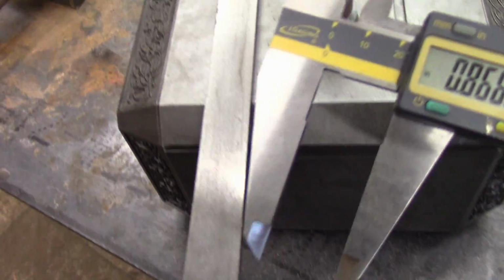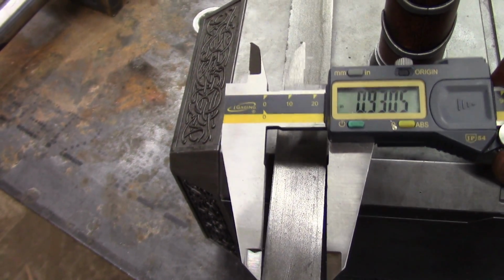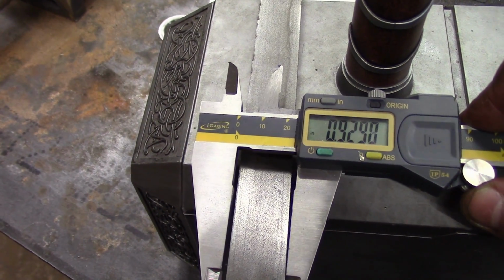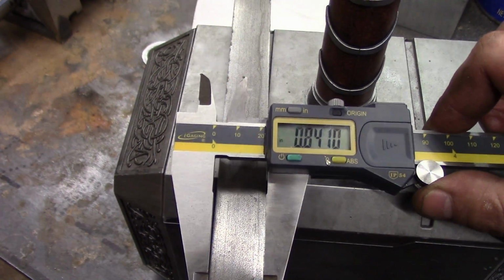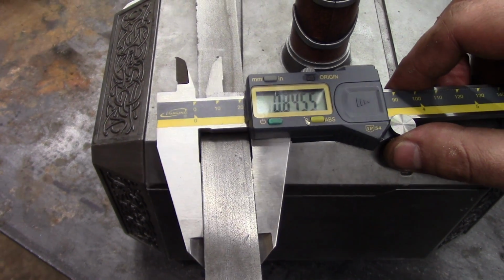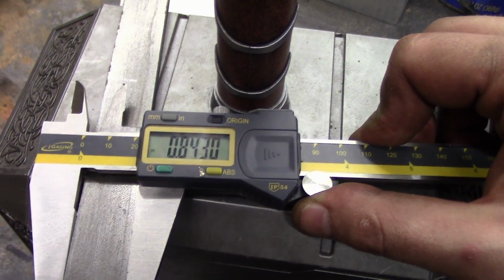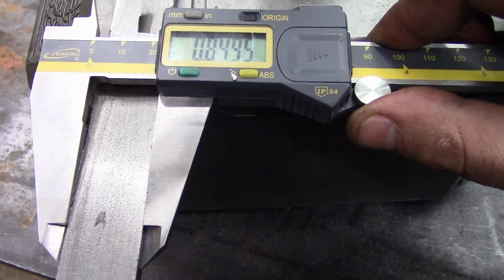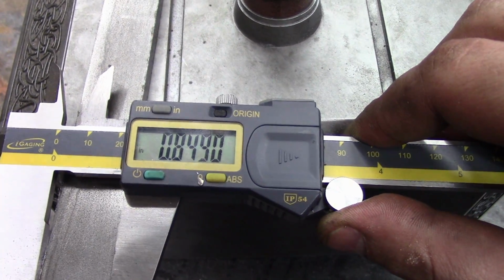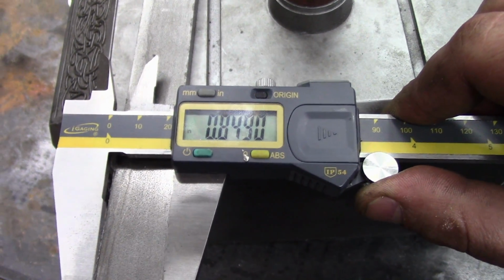Alright, so I've got both sides milled here. Let's see what we got. I wouldn't get your hopes up here. I don't think I'm exactly a savant machinist on my first try. It's really annoying to do with one hand. Yep, I overshot at 843 it looks like. Let's try the other side. That side's a lot closer. 849, so only a thousandth off on this side.